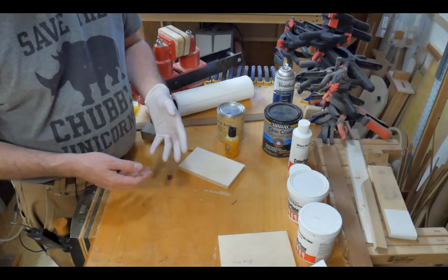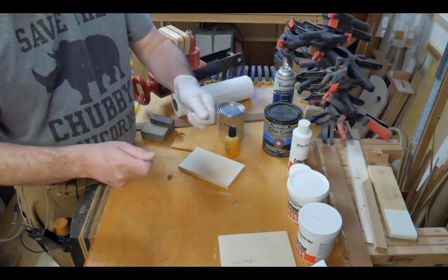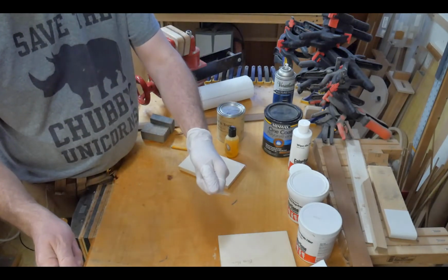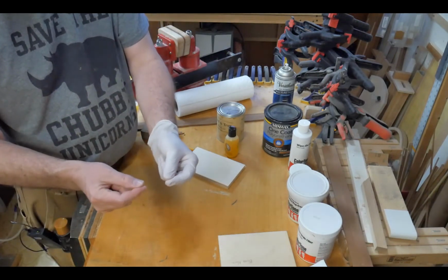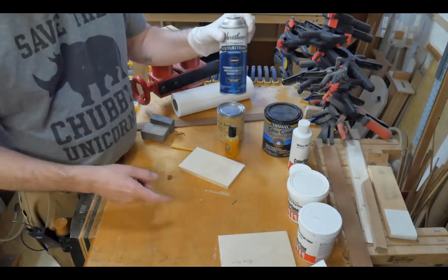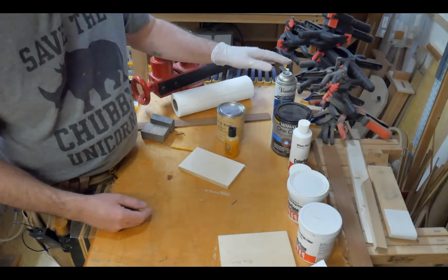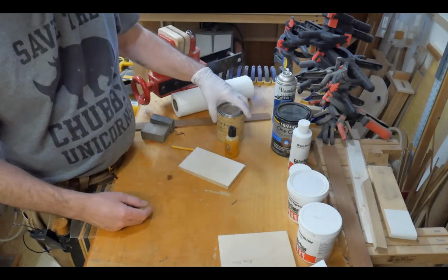So if you're using a drying oil, like a polyurethane or linseed oil or something like that, open up the rags, sit them out on the table, and when they've dried, you can feel it, the finish is hardened. Then you can pitch them, and it's safe. Rattle can, same as this other stuff, only you spray it. So these are all chemically very similar to one another.